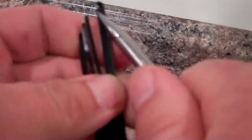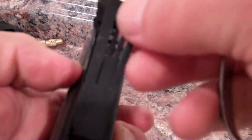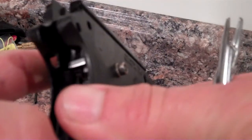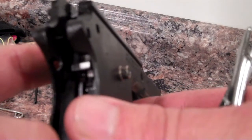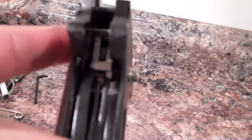I'm going to go a little bit further and try to make them almost flat. With your gun apart, reinstall your sear and your disconnector. Our first job is to only focus on the sear. You can see where it engages the sear, and then the middle one engages the disconnector, and the left one engages the bow. I'm going to do some more adjustments and I'll be back.